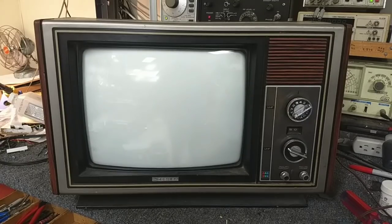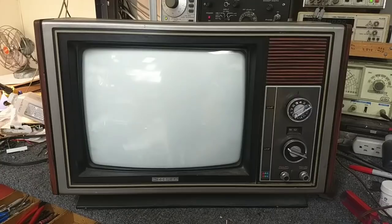Without horizontal pulses, the keying system doesn't work and the AGC voltages are not going to be quite what we expect — they were a little off. Anyway, we painstakingly put the chassis back into the cabinet and hooked everything up. So now it's a matter of turning the set on, seeing how it behaves, and seeing if we can dial it in a little better. We're going to start off with the handheld generator to establish a baseline.